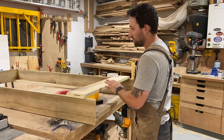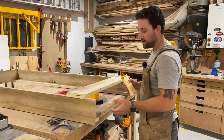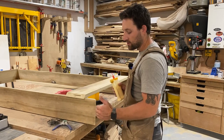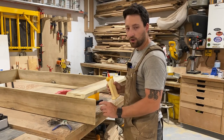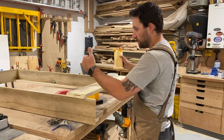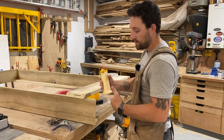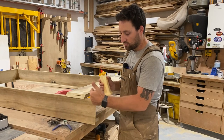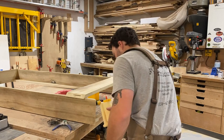So this is all going to be glued together to simplify the design of it, and it's very hard also to get this clean modern aesthetic with no extra lines without some type of intricate hardware to close these miters up, because typically you have a headboard and the footboard and it locks into it and it overlaps, and then you can lock the hardware in like this, click it in, slide it. With this, there's really no room for adjustment. So the easiest way is to glue it all together.